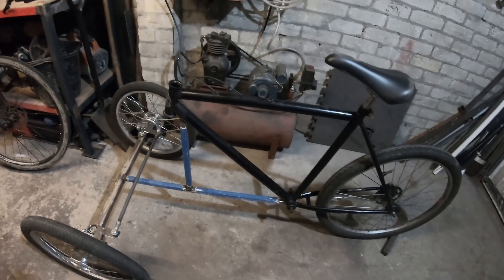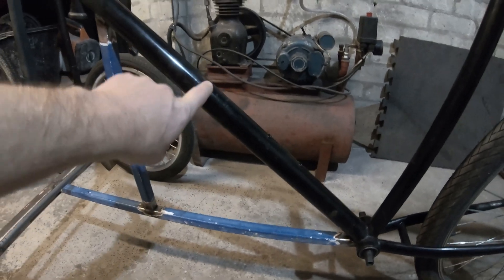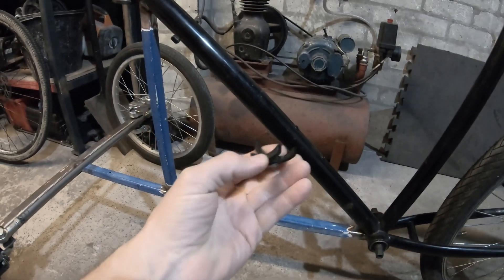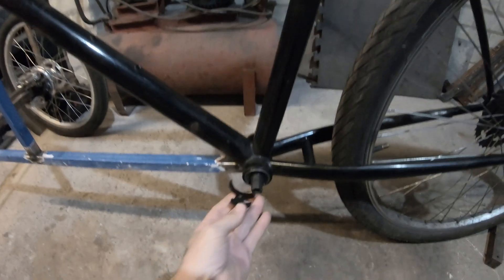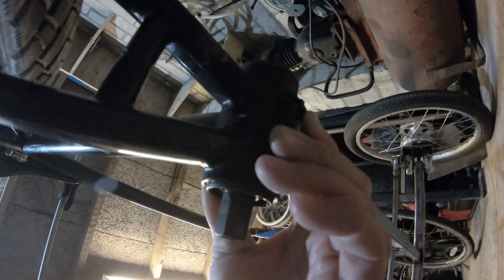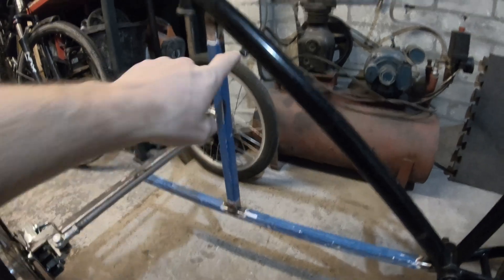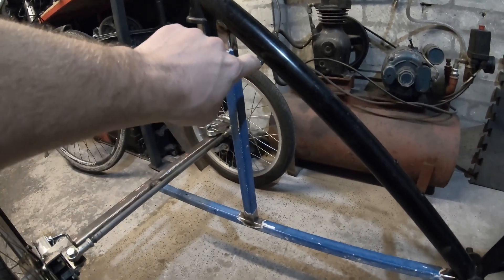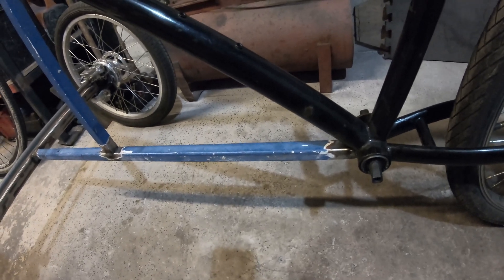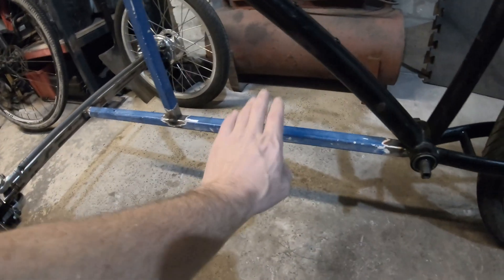I've got the tricycle built up. I went for this inch box, 3mm wall. On the other cargo bike I chopped the down tube out — this tube here — and just made it a square. But cable routing is such a nightmare. This is the original cable route — this plastic cable guide that goes under there. I've made it so that still fits under there, so I can use the existing cable guides. On the other cargo bike I cut these sleeves off and just tacked them onto the frame I built, but it's a real faff. So I thought I'll just leave the down tube in this time and use the existing cable guides. That's why I've had to use this inch box.